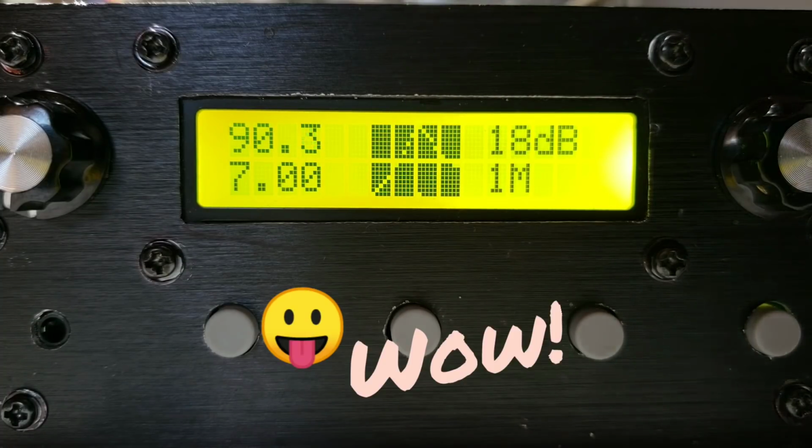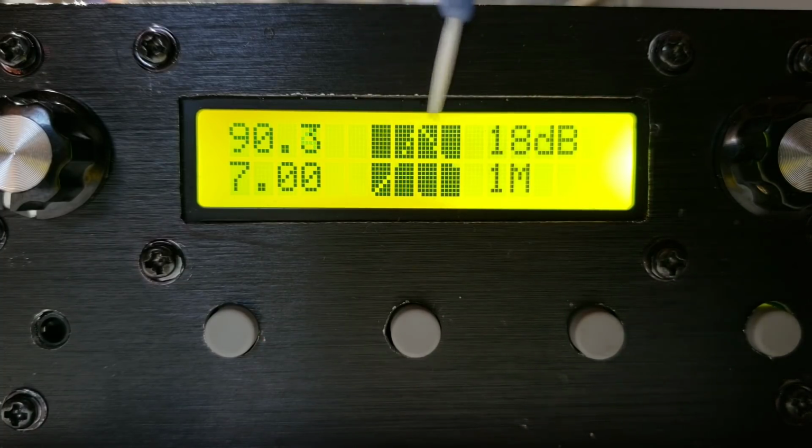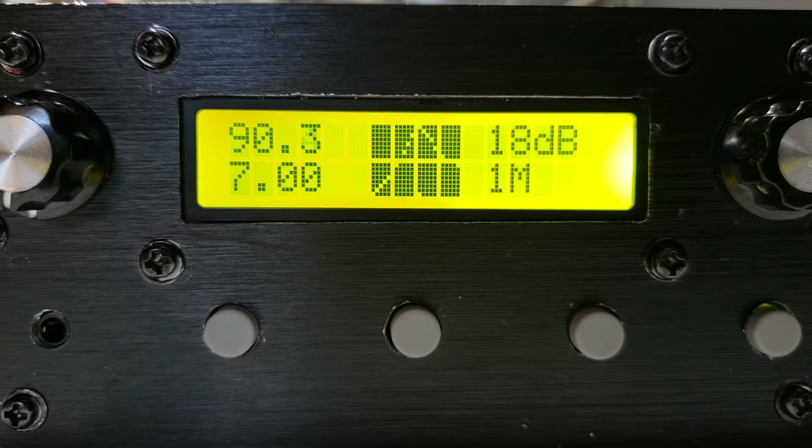You can imagine it really as 23 pixels wide and 17 pixels high once you take into account the non-displayable graticule divisions, which are the gaps between rows and character columns in the display module.